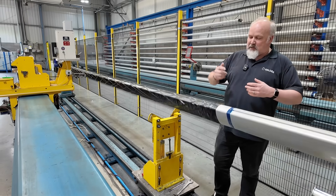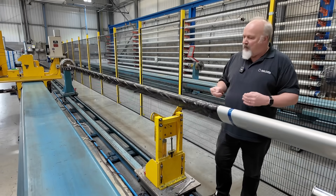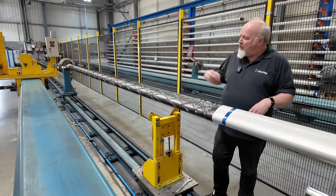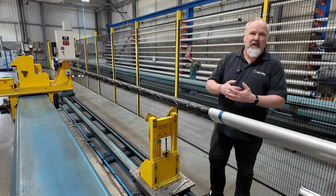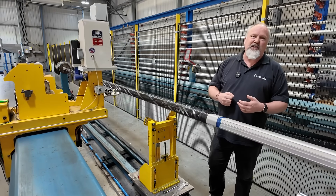The designers program it — whether it's going to be 45 degrees, 12 degrees, or 90 degrees — and again, that comes down to that custom profile that every spar goes through. Everything is laid under tension in the same way that reinforced steel concrete is made. Everything is done under tension so when it's baked it is as rigid as we need it to be.